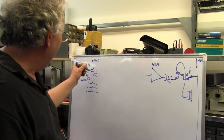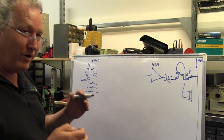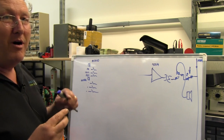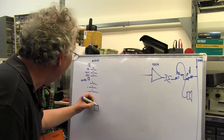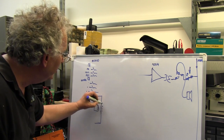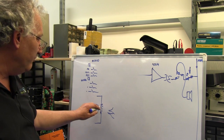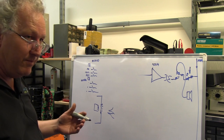Okay, these are just switch signals from a box. Now, this is the other aspect about poor quality announcements. The microphones for the guard and the driver are dynamic microphone capsules, embedded behind perforated steel mesh. So picture these little microphone capsules with a diaphragm, mounted behind stainless steel with a bunch of holes. When you're talking into that, there's a fair amount of low-pass filtering applied to the speech by those holes, based on the diameter and the pattern of the holes.